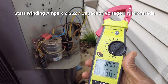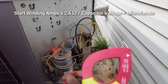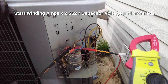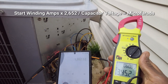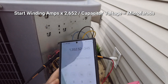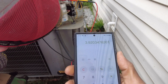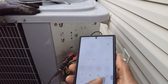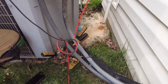Now grab the voltage — put the meter in volts. Going from the fan common terminal on the capacitor side. We're going to divide 1,352 by 345 volts — that gives us 3.9 microfarads. That means it's out of tolerance. It's asking for 5 microfarads. To be within the 6% tolerance, I'd need at least 4.7 microfarads. It's out.